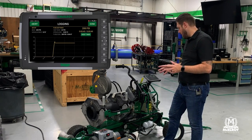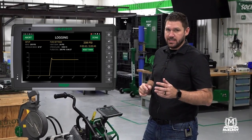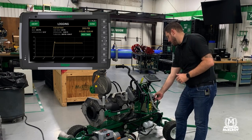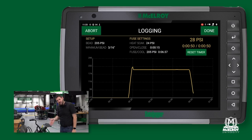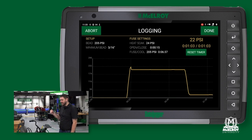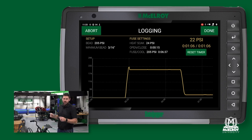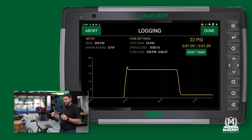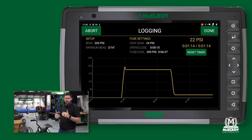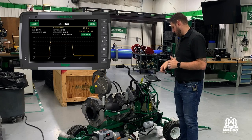As soon as I've met that requirement, I'm going to shift down. This is a really easy process, and it's something that's really good for the data logger. I'm going to take this, move it into the heat position, and you're going to see that pressure drop. You have all the time in the world — let it get down to drag pressure. Drag was 24, we're at 22. We want to be at or below drag pressure; it does not mean we're at zero pressure. We're translating interfacial pressure — drag pressure represents zero interfacial, but it's okay to be reading some pressure as long as it's at or below drag. That's really important.